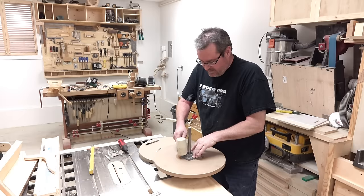All in all, it was a great project to do. I had fun doing it. If I had to do it again, I think I would change a few things, but not much. For a more permanent build, I think I would start with steel for everything. That way I don't have to worry about it being out in the weather or using water with it. Another thing is, I think I would pick a different time of the year, one when the black flies are not swarming. That was a rough day with that. They were driving me crazy, working hard at it. So I kind of lost my patience a little bit. I really should have stopped after, say, the 4th cut and sharpened the blade. And that would have really helped out with how well it was cutting thereafter.